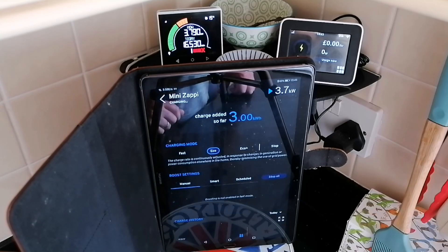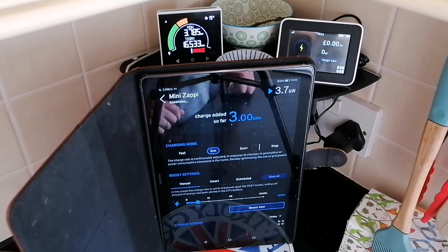That all looks correct to me. Now going from fast charge down to Eco — this one's quite interesting because the battery is currently providing some support, providing the 3.8 kilowatts, since there was only about 2 kilowatts of solar. It's in Eco mode now but it's not reducing — look, it's holding at 3.7, 3.8 kilowatts. So the battery's not letting go of that power; it's seeing that there's a load so it's providing the power. This is what I was saying before: it does support the charge, and even when you are trying to use only what's solar, sometimes the battery has hold of it and is providing the energy. The Zappi is saying, 'thank you very much, if that's available I will use it.' But what we're going to see in a few moments is that over a short period of time it does start to drop off — once it decides it's going to let go, it starts to let go at about 100 watts at a time.